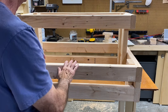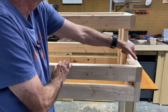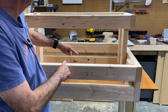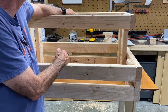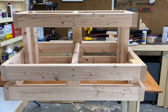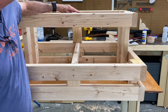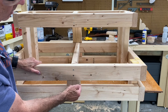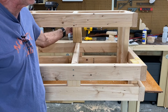It's starting to look like stairs now. My treads are going to run lengthwise along the stairs, so I'm going to run one board as a support in the middle and do the same on the top step. We also added an extra support using those inch-and-a-half pieces I cut — one goes right in there, and another on the back side too. So this thing is going to support plenty of weight.